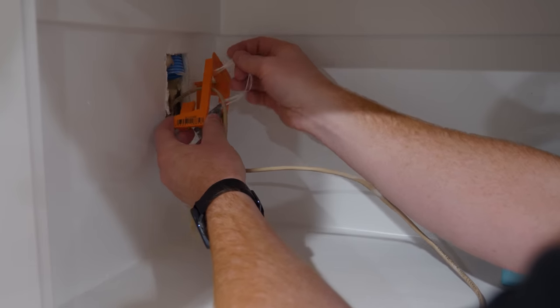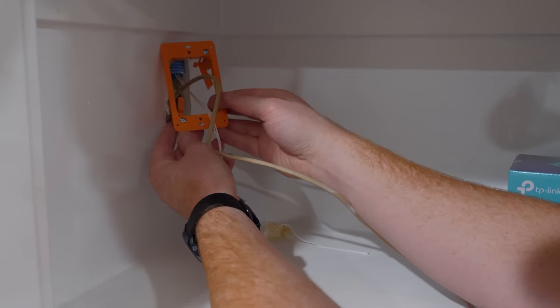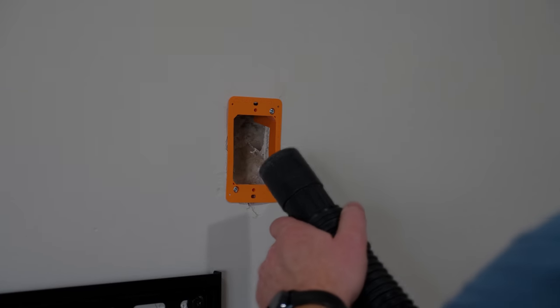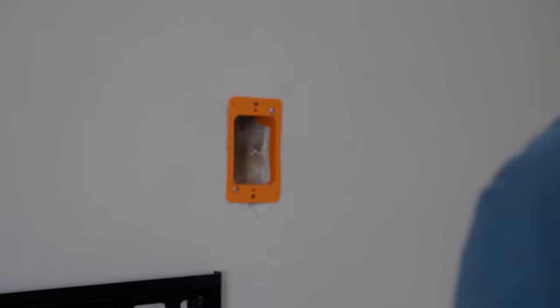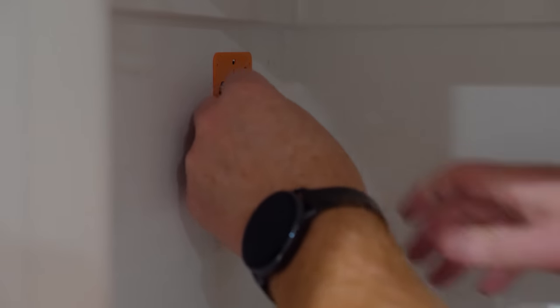Now what are all these strings for? That's going to be how we pull the different cables through. If you don't have string through, what you do is tape a little baggie on the string on one end, and on the other end you use a vacuum — it will suck the bag through with the string. We got it! Then you can easily have a pull string added, and we did that a few times to get all the strings in place.